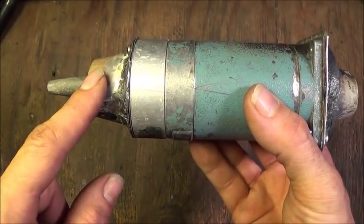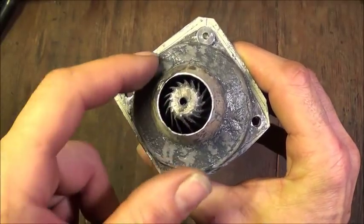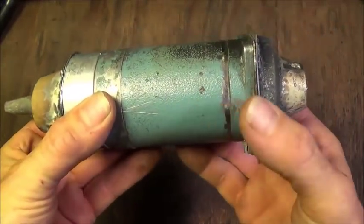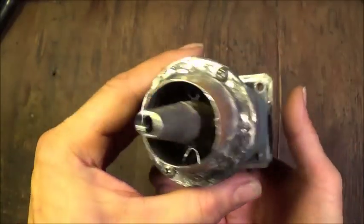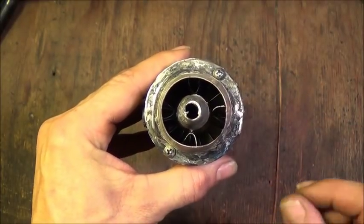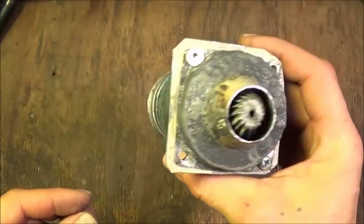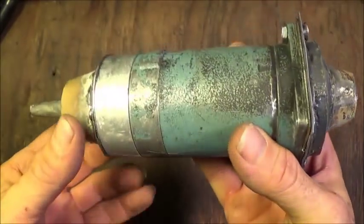I've now added our output nozzle, an aero spike out the end, we've now got our compressor fan, we've got our cowling around that, I've got a diffuser underneath the cowling, and I'll show you that here in a moment. We've added a protection system for our drive shaft and our bearings on the inside of the case. I've left the aero spike hollow for our first test — if I don't see what I'm looking for I'll go ahead and weld that shut, close it off, and grind it down. Let me go ahead and undo these screws, open it up, and show you what it looks like on the inside.